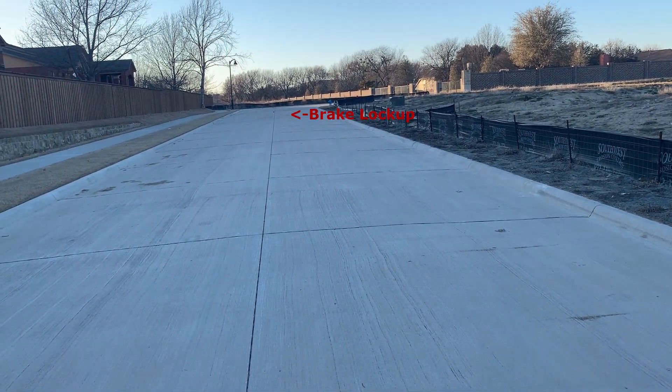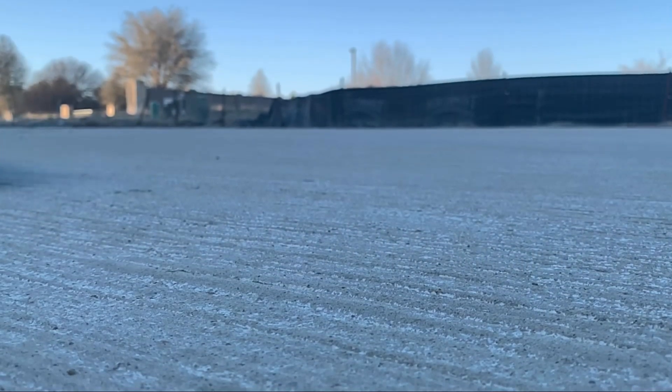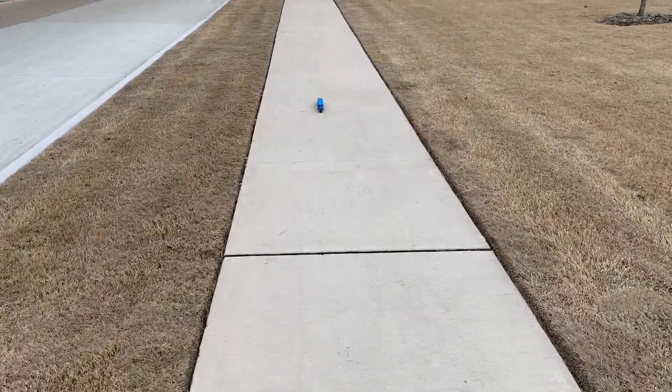It's probably time to talk about some of the big flaws for the car other than it just breaking in half. The biggest issue now is the braking itself — all the braking is done by the rear tire, which is very destabilizing. I can't keep crashing every time I want to stop, so I need to improve the braking system. Maybe looking at adding downforce, an air brake, or a parachute — I'm not really sure what the best system will be. If you guys have any ideas let me know. I really need to focus on making this reliable and easy to drive, which I'm realizing is a big part of the challenge of speed racing.